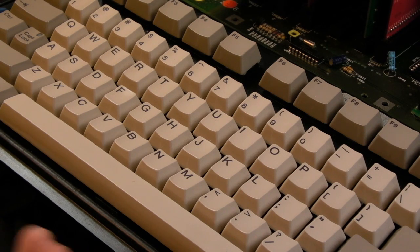And, alright, I was only in the industry for about 5 years maybe back in the day, and I cleaned thousands upon thousands of keyboards with IPA. It was the go-to. If you look at lots of manufacturers in terms of what you should use for cleaning your keys and your screen on your laptop, IPA. That's what they suggest. They don't say don't use IPA, it'll dissolve or crack keys. No, it doesn't. It doesn't dissolve plastics. It doesn't affect plastics.